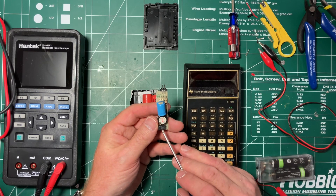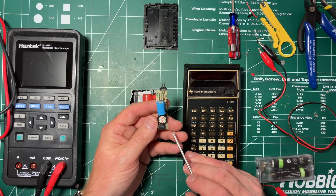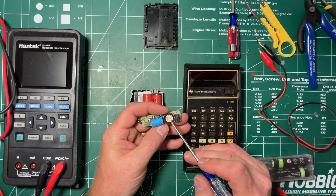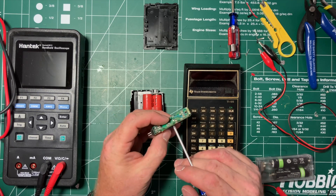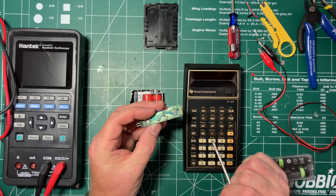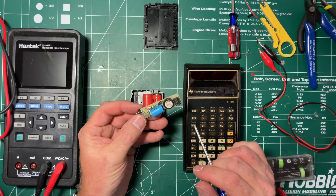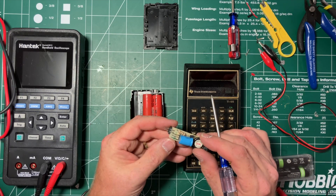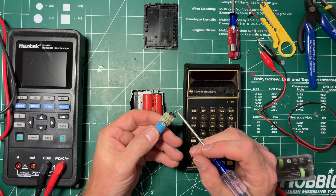It would be possible to look up this chip, since it's a TI chip. It says 1, 2, 7 down the side, and BP5IC-3A, then Malaysia — that's probably the chip number. This is AC on the top. My guess is this is an inductor — it's going to be a step-up, it's going to drive the inductor. Then it's got a big capacitor, which seems fine. This diode looks like polarity protection from the wall plug. So fairly straightforward — not very different from a current power supply. So it's a buck-boost.